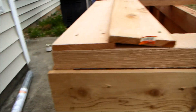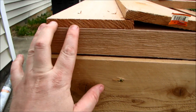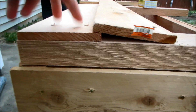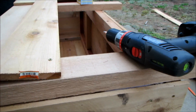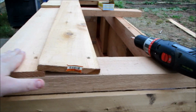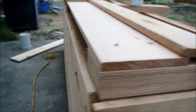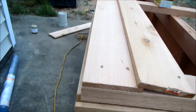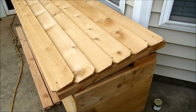What we're doing is almost like an outdoor vinyl siding overlap — just like regular cedar. Your bottom board will be perfectly flat, and then the next board overlaps by a half an inch. This is the only board that requires two screws; everything else only gets one screw at the end, which will be almost covered by the next board. It's going to be angled up so water just sheds down. It's obviously not airtight because of the gap, but between the angle and the air at the bottom there should be enough airflow.